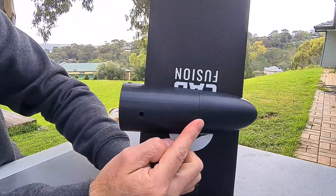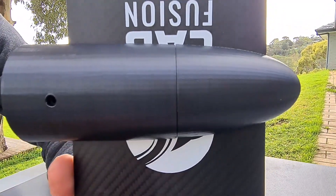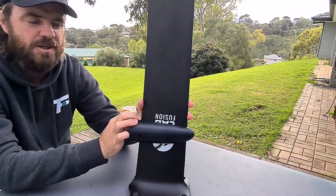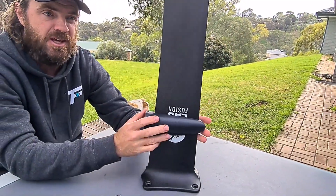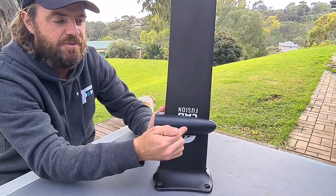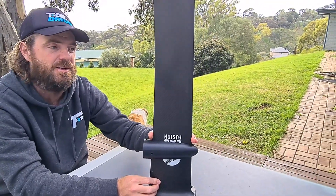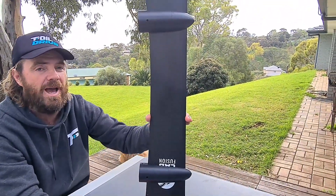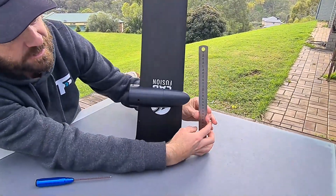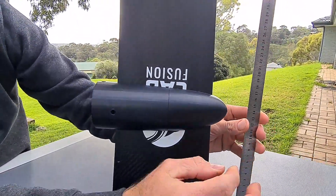So now the gap has closed. Normally the pods are designed to have a very small gap between them to allow clamping force around a mast that's more symmetrical. But in this particular one, there is no gap because we need the pod to pull up tight against either half — it can't reliably clamp on a tapering surface that actually falls away in width; it'll naturally want to fall down. So that's 18 centimeters to the center line of the pod, and it fits beautifully.